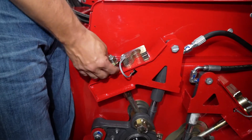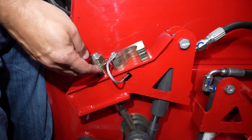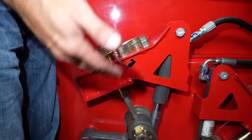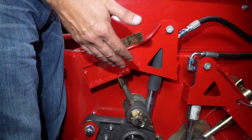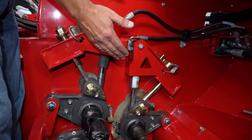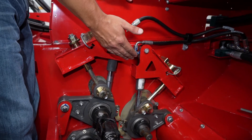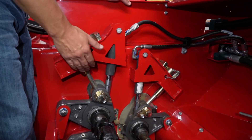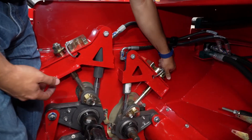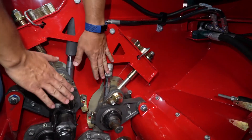Now that I've taken pressure off, you can see there's a gap here. Since there is a gap here and you have taken that bottom bracket off, you can see all of the pressure on the roll is down. We'll also do the same thing for the front side, since this is a 9316D TwinMax double conditioner. We'll do the same thing for the front now. So we've zeroed out this — I've done the front side as well. So now you know the rolls are sitting all the way down.